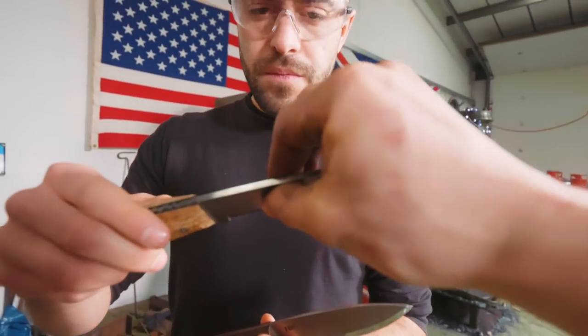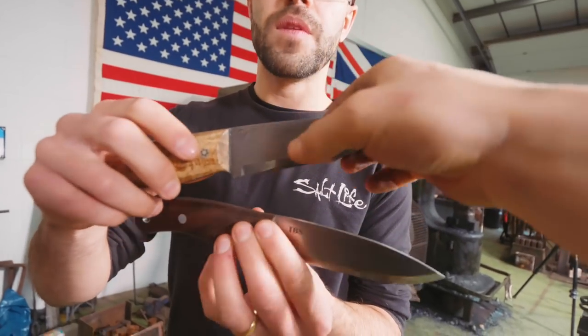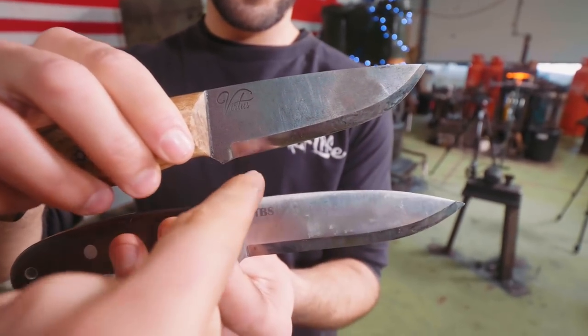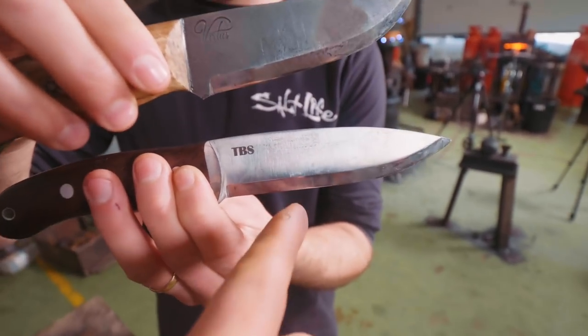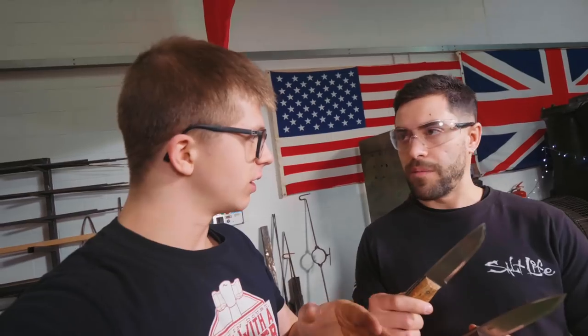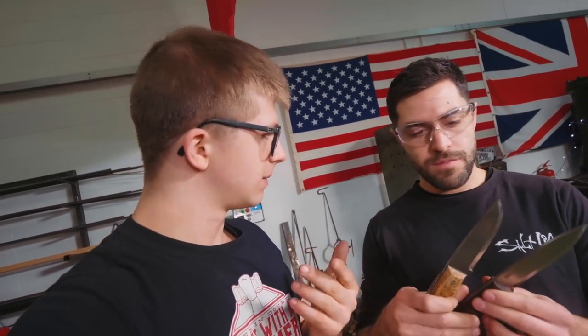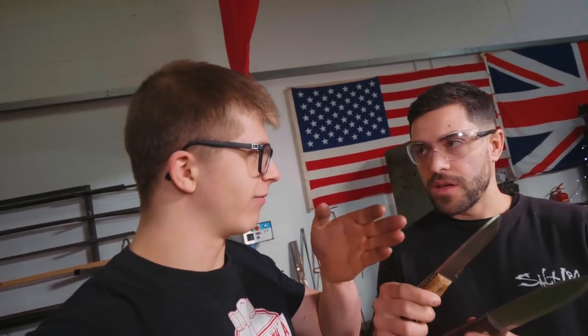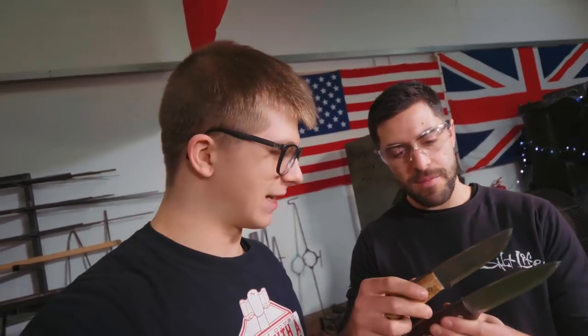It's really, really thick — a really long way down the blade. I was really surprised about how little of the blade actually has a grind to it. It's only ground in the last like three eighths of an inch. Am I right in thinking Scandi grind is just one straight bevel straight to the edge — no secondary bevel at all? That's right, just straight to the edge. When people sharpen it, you'll generally get a micro bevel, but you can deal with that — just a very slight appleseed right at the edge.